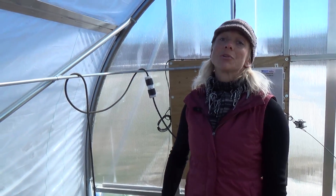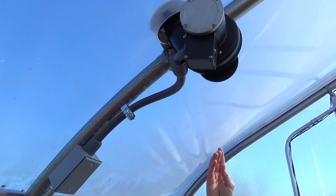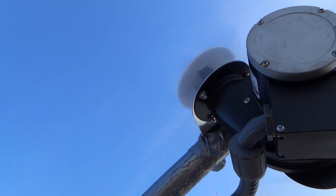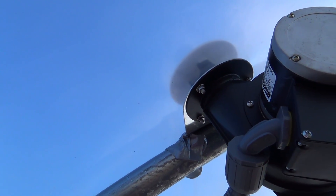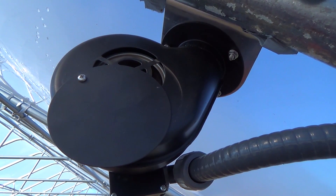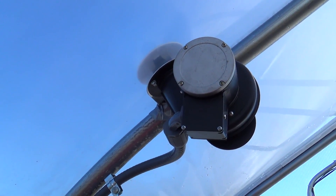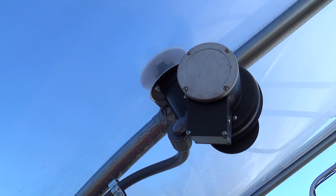For double-layer poly, it has to be air inflated, and generally you'll use an air inflation unit like this blower unit. It has a deflector on the outside that prevents the outer poly from drying out, pushing and moving air through the two layers. On the other side is a door that pulls air in and only needs to be about a third of the way open for sufficient inflation. These units need to run 24 hours a day — they're electrically powered but can be hooked into an extension cord if electricity isn't easily accessible.